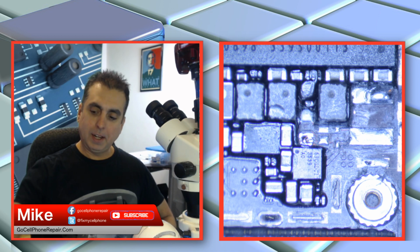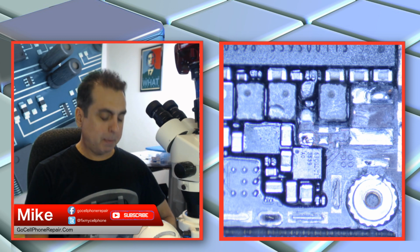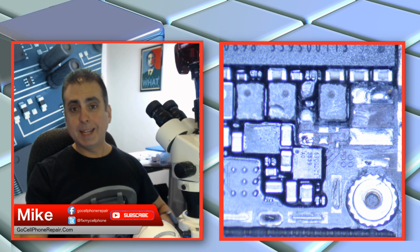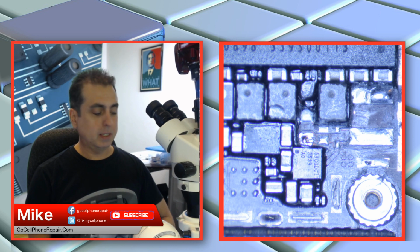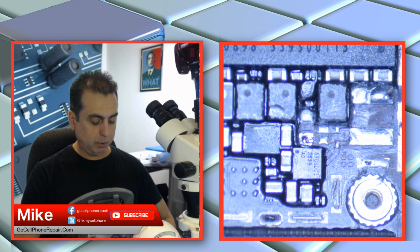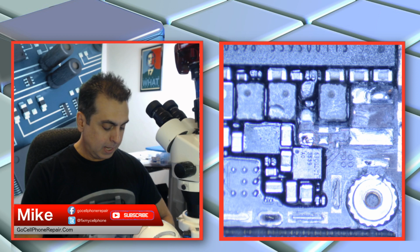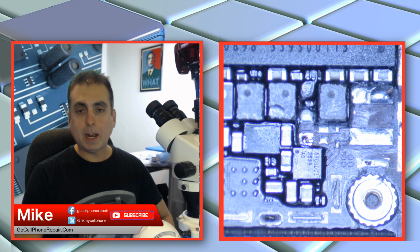So as I said earlier, I can put this thing on the power supply, and every once in a while I can get it to boot, but the last time it did boot successfully for me was probably about 3 or 4 days ago, and since then it hasn't been booting up. So I don't know if this thing's going to come back, but where would you go next if you were having this kind of problem? Like, it looks like it's charging, but again, it goes into the boot loop. So whether you're looking at the ammeter or the power supply, you get the same thing. It goes through a normal boot up to a certain point. Oh, and just like the one that I had a while back, right before it completes booting up, it goes to a very high amperage draw.